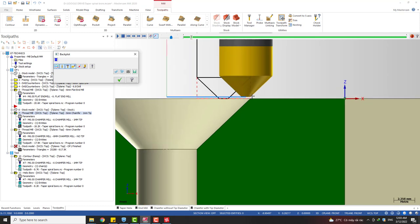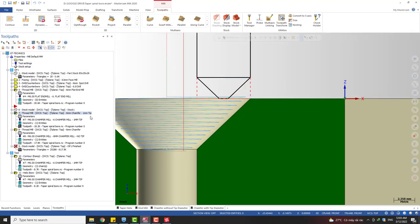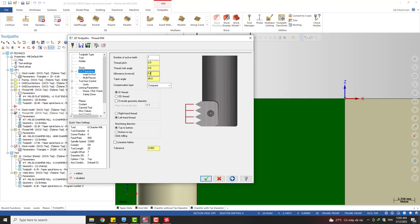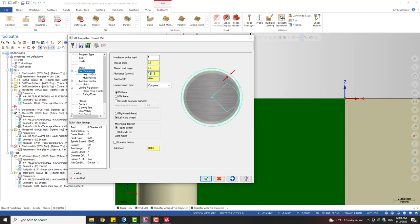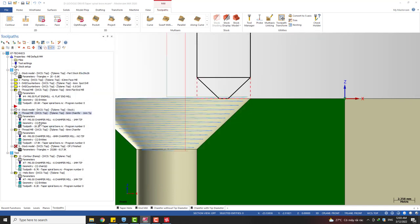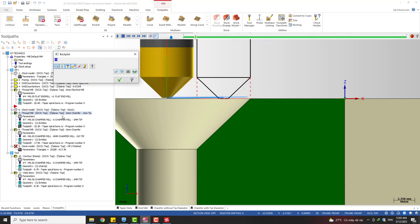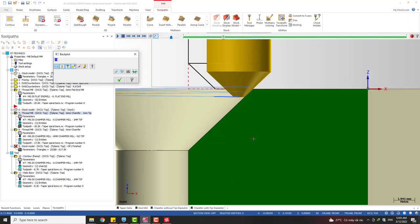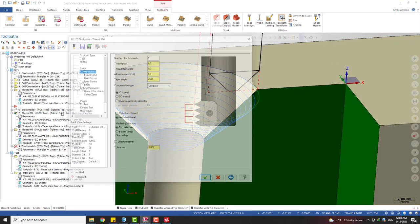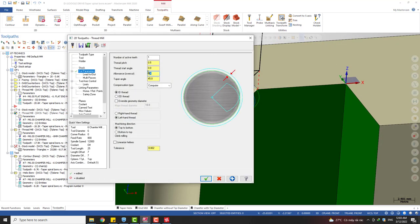Yeah, but when you move the tool up, you need to expand it. So you move up 0.2, the diameter should be 0.4 bigger to move the tool back to the correct position. Yeah, like this. See that? So take into account this number, very important.